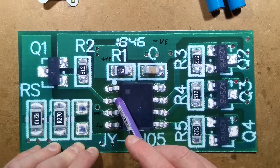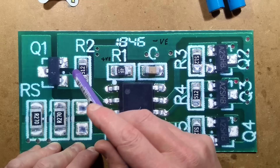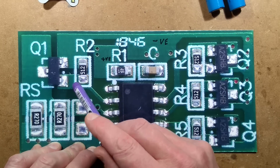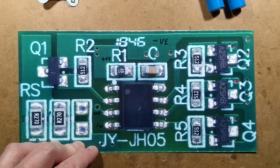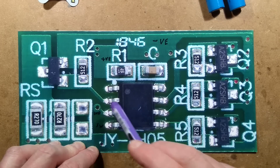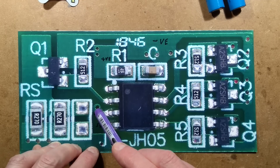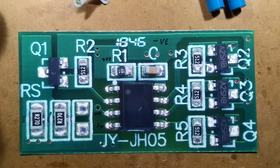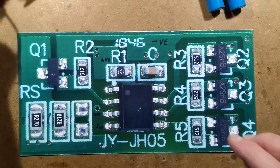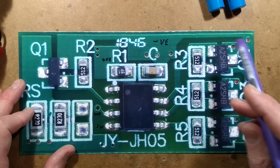The microcontroller controls the four MOSFETs directly — a pin goes out to each of the gates. These 512 resistors — 5.1K ohm — are connected to the negative rail just to keep it turned off, to make sure any floating voltage won't affect the gates, because that's probably when this is put to sleep they may just go floating. It's just to make sure the MOSFETs don't partially turn on. There are two input pins — the switch goes to pin 4. One of them is an output pin: pin 3 is the indicator that goes back via the white wire to the battery pack circuit board in the back, and that's what brings those lights on — it's just an enable signal going out whenever you've got any mode, powering up the indicator lights on the back of the battery pack.